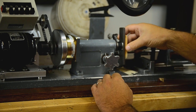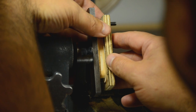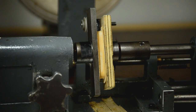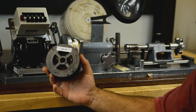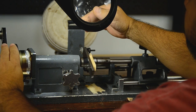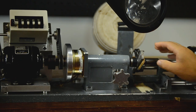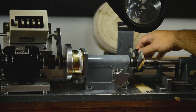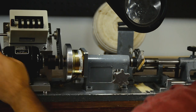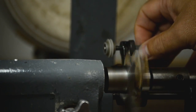Time to wind. This is a pretty expensive machine, so look for future videos on home-built winders. I'll put about 6,000 turns of 44 gauge plain enamel wire on this. We'll have the half pound spools available soon. 44 is an extremely delicate wire to work with and it takes some practice. Here you'll see the derailleur laying the wire down.